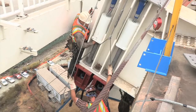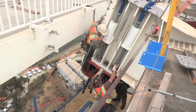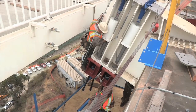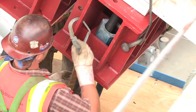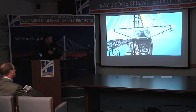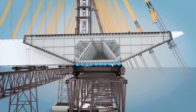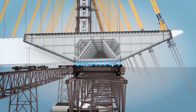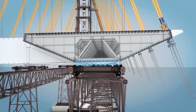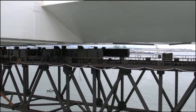Here is the team actually out there in the field above the bay. You see the cars down there? While the jacking is happening, you can see the nuts that they're placing by hand at these different locations. The whole point here is to get separation — to actually lift the bridge. This is exaggerated a little bit to really take home the point that we're lifting off of these cradles and this temporary bridge and putting the weight onto the cable system itself. Then the cradles are removed. We've already started removing some of the cradles closer to the eastern side of the bridge — you can see they are gone. You can also see the separation at this location and that the bridge is holding itself up now.